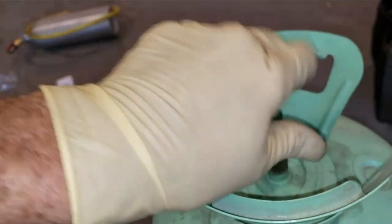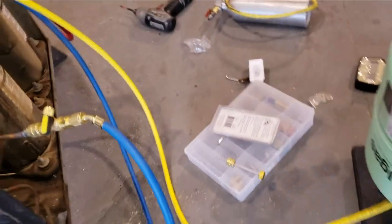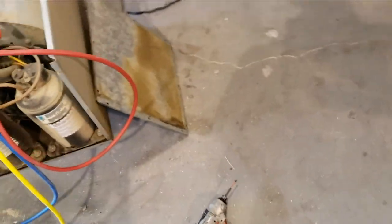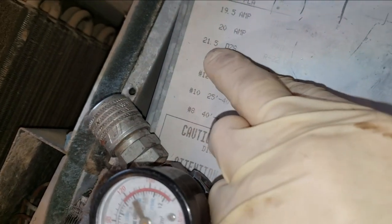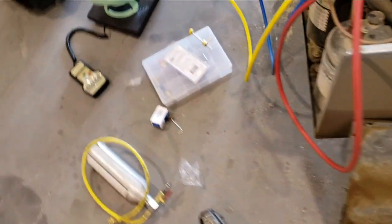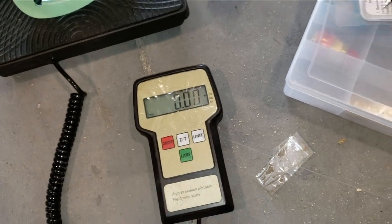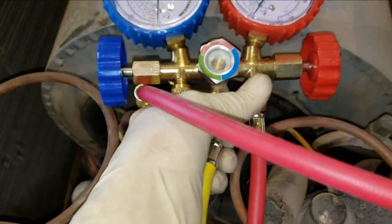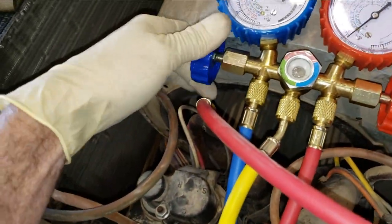All right, that turned on. Flip this upside down. Now I'll get liquid into there. Now on this setup, we want 22 ounces. There's about 2 ounces in the line, so I need to put in about 24 ounces. Go ahead and turn that on. I'll tare that at zero. Let's go ahead and clear the line. Okay. Open that up.